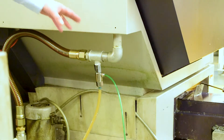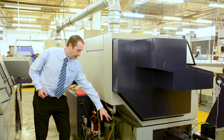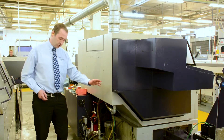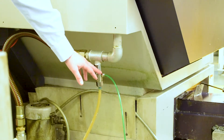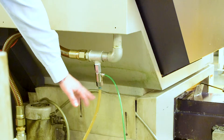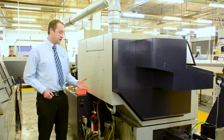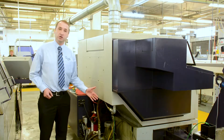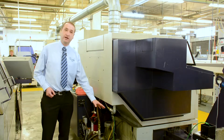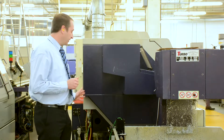This hose has a filtered vacuum cup that sits in the bottom of the swarf bin. The oil that is dragged out with the swarf and into the swarf bin is then automatically sucked back — as soon as the machine is working, it creates suction that drains the bin and returns the oil to the sump. That needs no manpower; it works automatically when the machine is on.